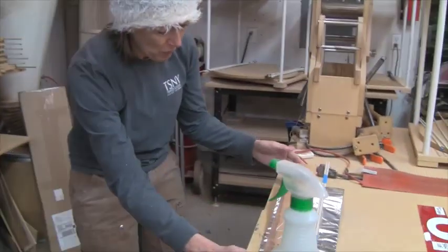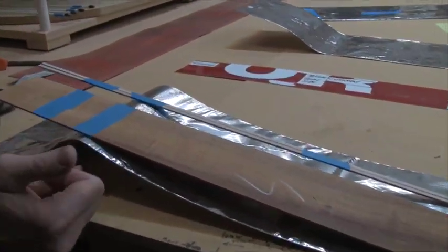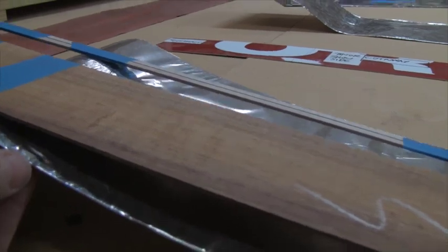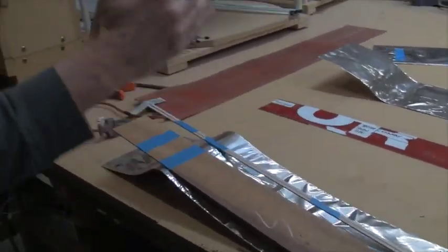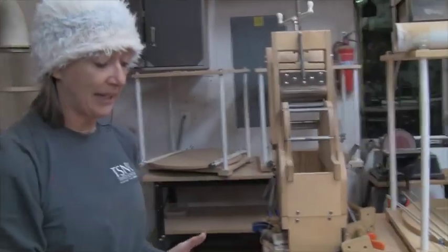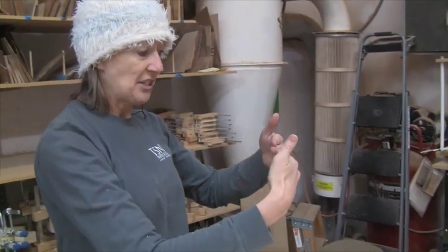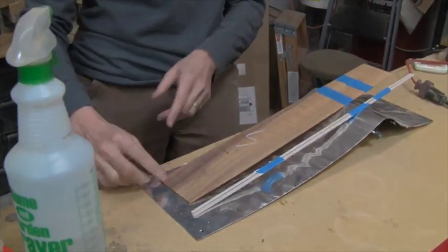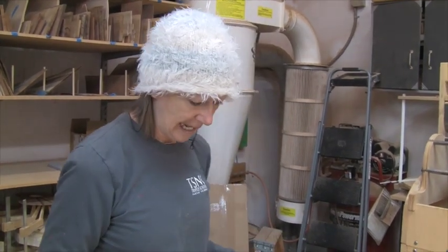The other thing I wanted to tell you is that when these sides get profiled the center of the waist gets marked, and I have that lined up here on my metal pieces so that when I put those into the bending form I can line that up. The goal is to get the ends at the tail of the instrument to match up so I have a beautiful book match — you can see the darker areas — and that waist mark is key to getting that to happen.